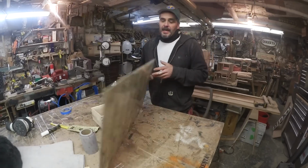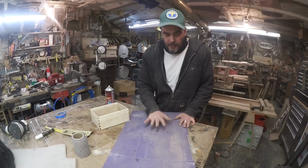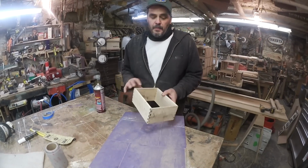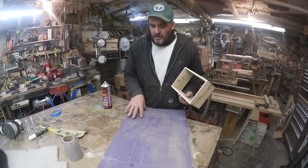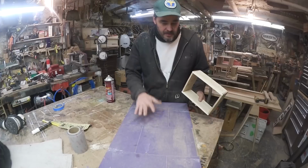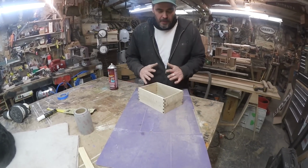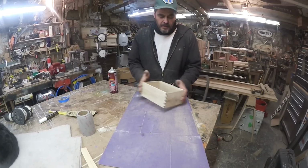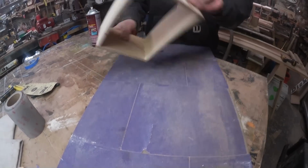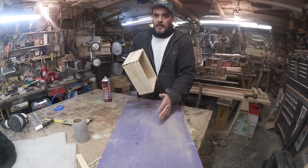What I have here is a piece of glass, and if you want to sand things and get them nice and flat, I recommend using a piece of glass under sandpaper on the table and moving your model on the sandpaper. Here you see I have 80 grit sandpaper just spray glued to the glass. You've got to be careful because as it ages, the spray glue lets go. To avoid tearing the paper up, I always hold my model at a 45-degree angle to each one of the joints of the paper. It's great for mirroring the flatness of the glass. Your object becomes flat as well.